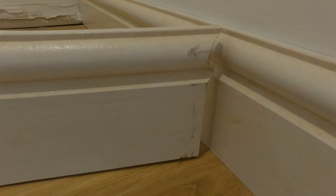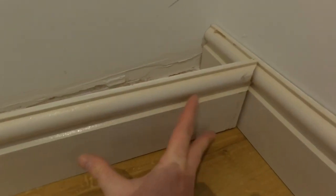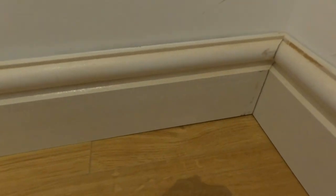As you can see, I'm going to show you properly. This side scribed and this side scribed — so you get that end in there, and then here. Perfect. Like I said, you don't tend to usually do a double scribe — you usually do one side, and then the other side's just a straight cut against the wall. But hopefully that gives some insight. I tend not to do it because it's a lot more faff. Try and do one side — a lot easier, saves a lot more time, get a job done quicker.